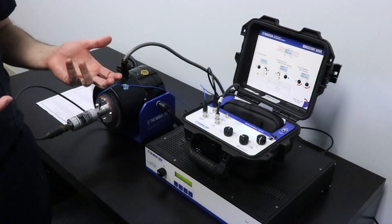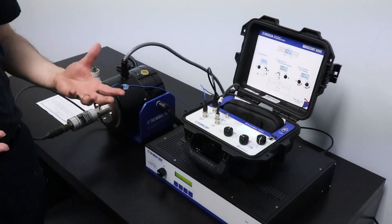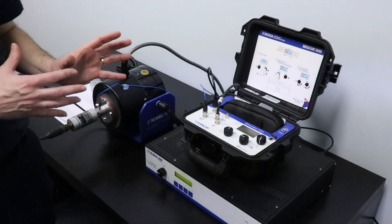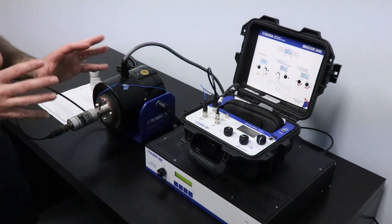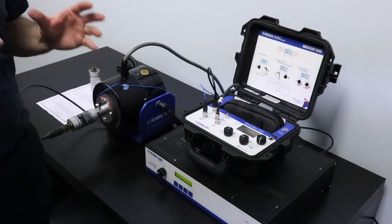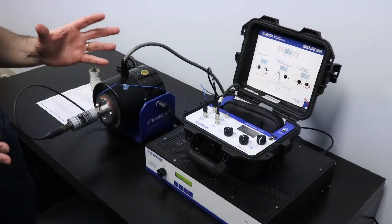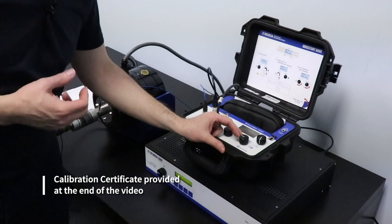This kind of testing is done at a reference frequency of 100 Hz. The sensor is designed for a broader frequency range — this particular sensor can go all the way down to 4.5 Hz, which is approximately 300 RPM, all the way up to 1000 Hz, which is 60,000 RPM. I can quickly check the sensor at other frequencies to make sure I'm getting the output within the range that the sensor is specified.